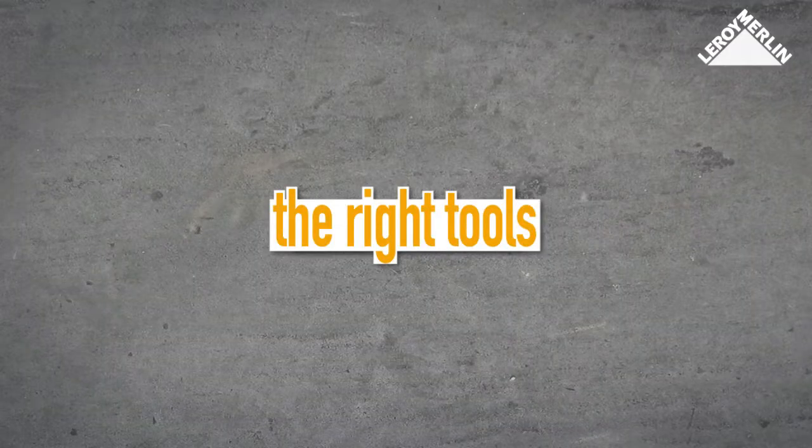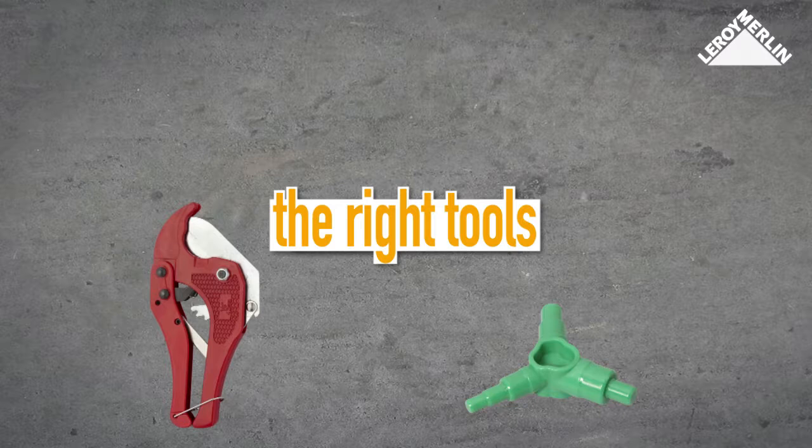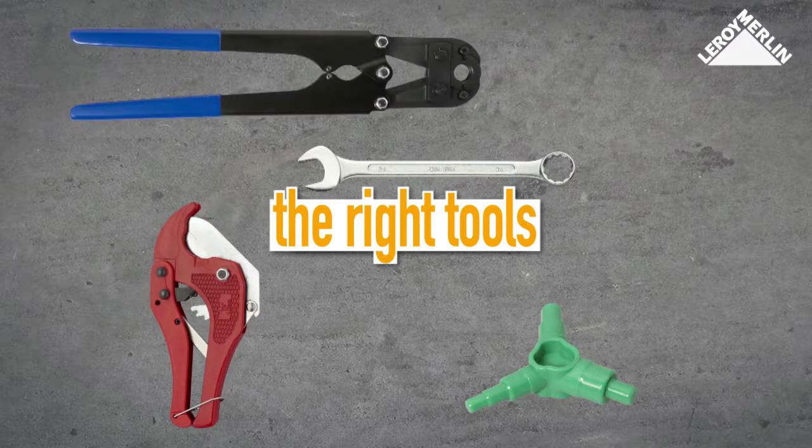For self-sealing connectors in small projects or small repair jobs, you will need a pipe cutting wrench and a sizer. For compression joints and small to medium jobs, you will need a pipe cutting wrench, a sizer and a spanner. For crimped joints and large projects, you will need a pipe cutting wrench, a sizer and a crimping tool.